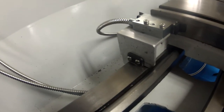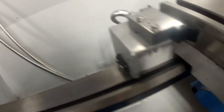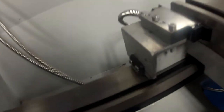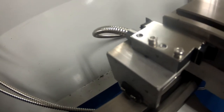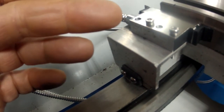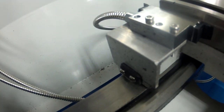The installation was very simple. I used the two holes that were already drilled for the way wipe right there, and just mounted the wipe right over top of the bracket. I used a one-eighth inch 90-degree angle bracket. The head is slotted and has about a two-millimeter adjustment built into it. So really all you have to do is, before you drill the holes, put the bracket and the head, mark it, touch it directly to the tape, and then mark the holes for full travel coming back. That way you'll have more than enough to set your gap.